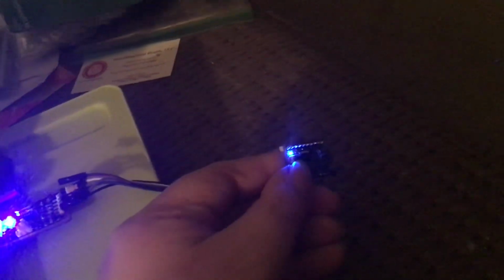If I plug in my FTDI adapter with the controller wire to it, and I connect the pin that holds this pin in place, it is going to exit program mode on its own in a few seconds. The light will start. See, it exited on its own. The light is flashing. The light is always on in program mode. I think it's a pull-up resistor that is always active or something in program mode. I don't know why, but no matter how many times I set that wire connected to it, it will not re-enter program mode unless I unplug it and plug it back in. But if I keep pushing that reset button, as long as I keep that pin powered, it will stay active for longer.